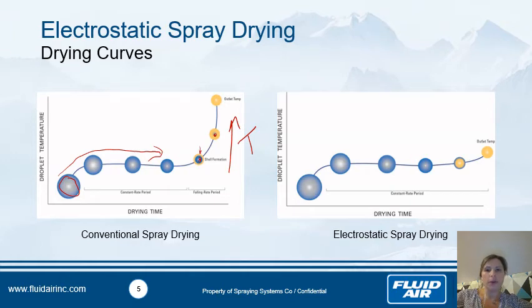In the case of the electrostatic spray dryer, when you apply an electrostatic charge, the water continues to move to the surface. Every time there is a charge, water easily diffuses to the surface. That's why you don't need high energy to evaporate your water, because your water is available at the surface. Moreover, you always have this thin layer of water, which means you have a good protection of your active throughout the drying. It's the same phenomenon as when you come back from the sea to the beach — you feel cold because of that thin layer of water on your skin.